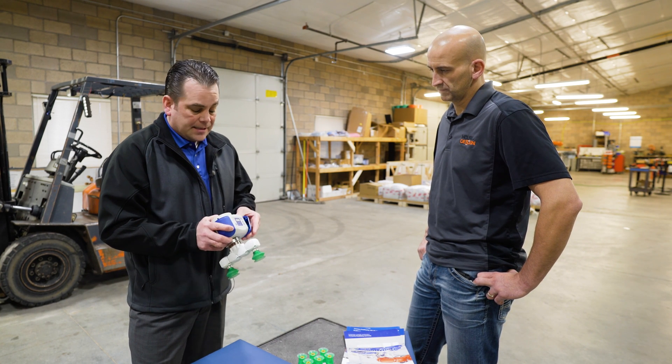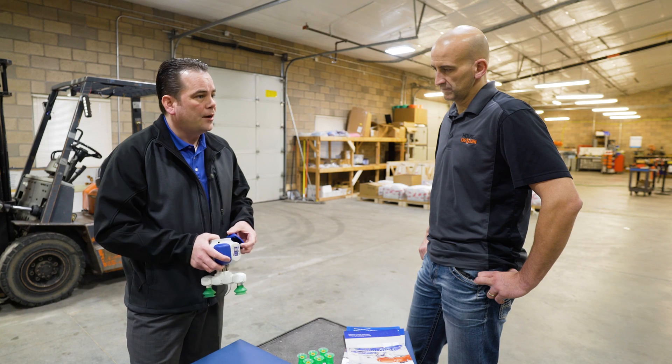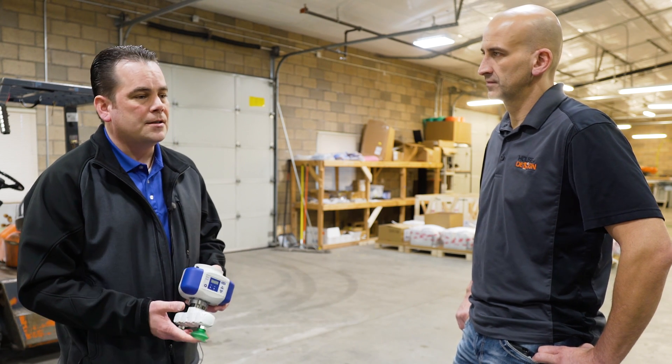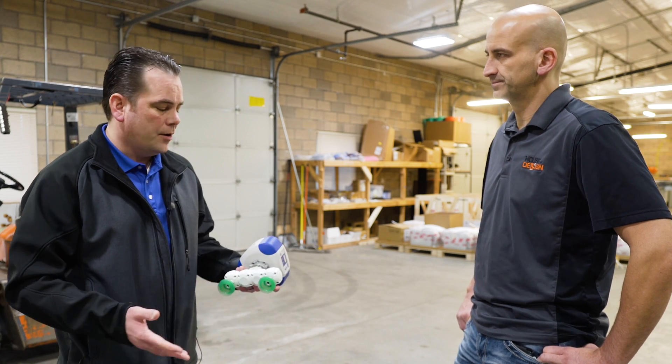This unit is capable of full monitoring of everything that's going on. It's only driving throughout a set range of vacuum, so it's not constantly running — it'll kick on, bring up the vacuum again, and then kick off. It also has a long-term monitoring process which, if it starts to realize it's not seeing that same vacuum level as it's picking and placing product, it'll send out a warning into your system so you can check the cups and make sure something's not torn or damaged.